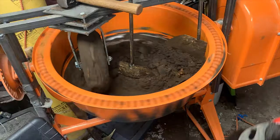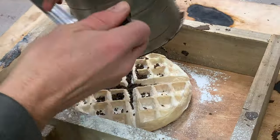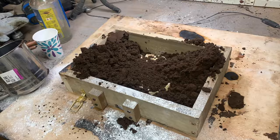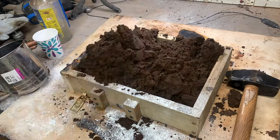I use a mulling machine to help prepare the oil-based sand called petrobond. I sprinkle an even coating all over the surface to capture the detail of the waffle, and once it's covered I pack it down until the sand becomes hard and rigid.